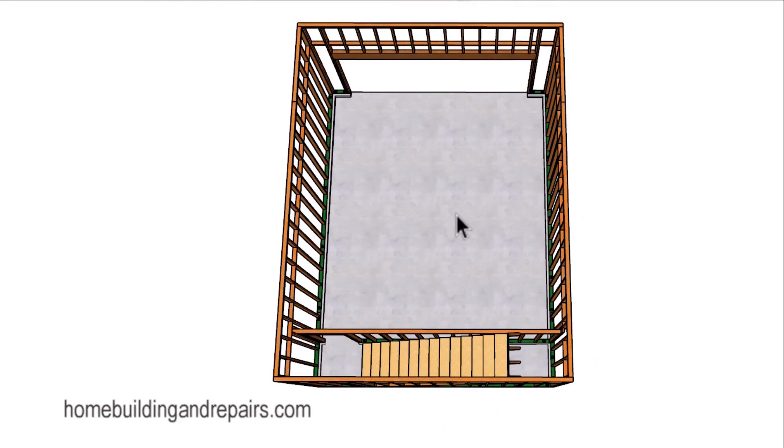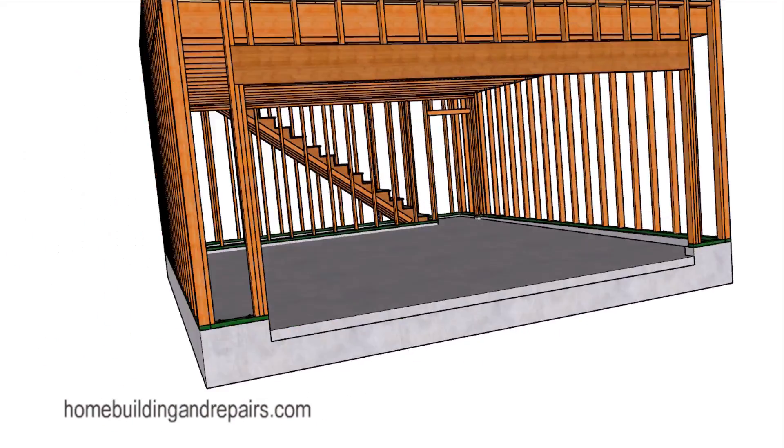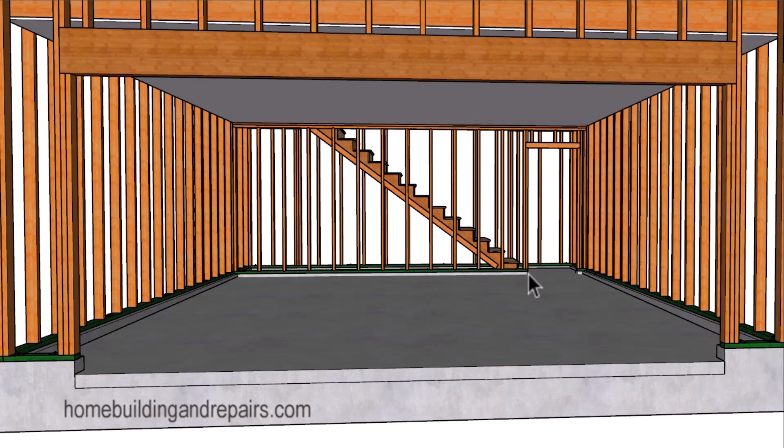The fire wall is a barrier that might help somebody who was trapped upstairs actually get out of the building instead of being trapped. So if we had a fire start down here, in reality this door isn't going to do you much good. You're not going to come down the stairs and then go through your one-hour fire-rated door into a fire that could be burning out of control already. This setup right here might not be approved by your local building department.